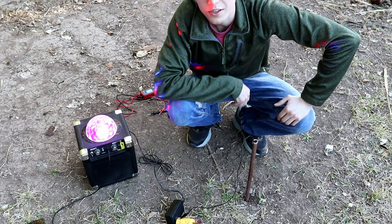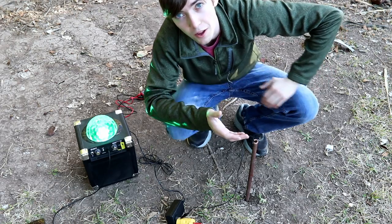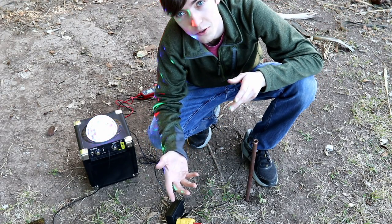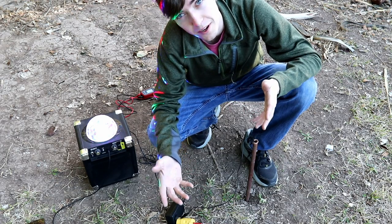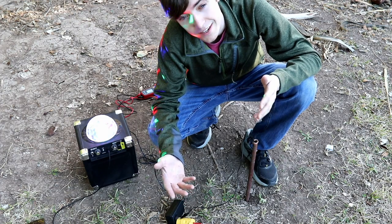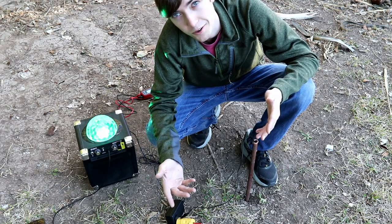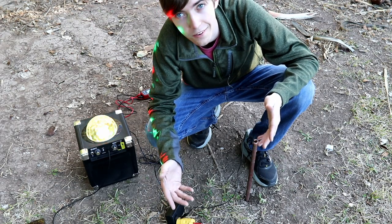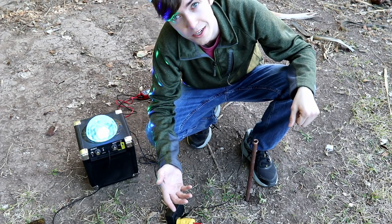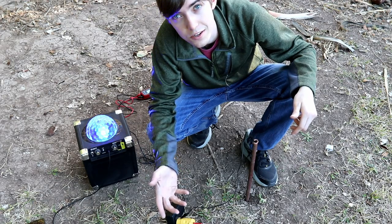It looks like it works fairly effectively. This is a demonstration of a relatively low-performance single wire earth return system at 120 volts AC. It works — it's probably not the best way to do it and does create its own set of hazards — but it does actually work. I'm really excited to find that my hypothesis about single wire earth return at lower voltages is in fact correct: it can be used for limited load supplies. Hopefully you learned something today about power distribution. Thanks for watching Dielectric Videos and I'll see you next time.